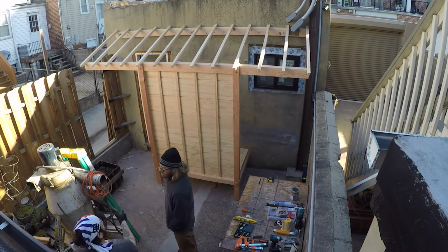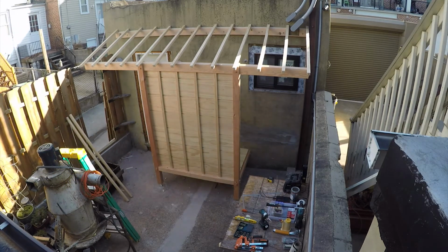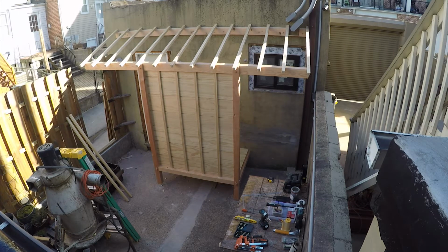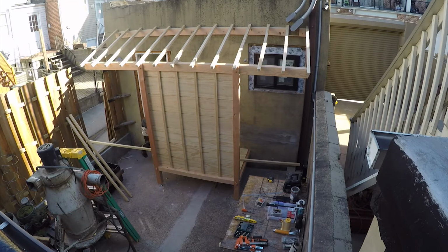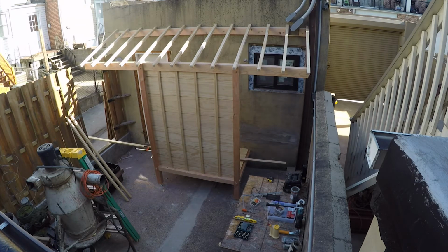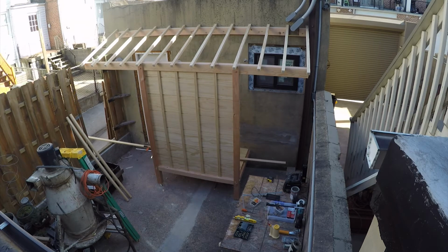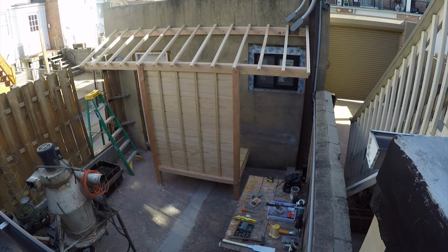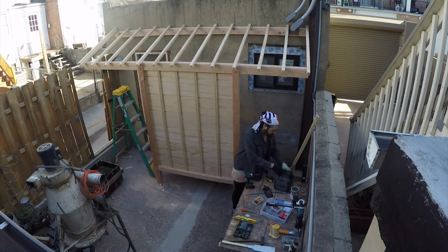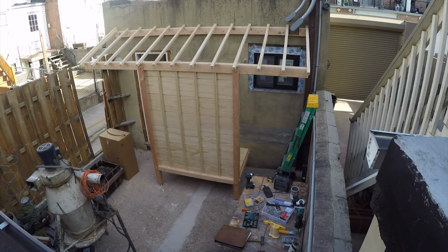So I got my friend started on cleaning up the dust collector, which I still haven't refinished just yet while I was working on the trim. The roof is trimmed with the same material as the rafters, which is finished 2x2s. There is one gap that sits in the center of the front of the roof, and this front piece actually has a 1/4-inch groove routed into it so that the first piece of tongue and groove slips into that groove. And so when you look up underneath the rafters, there's no seam and it looks really elegant. So you don't see any seams or breaks in the tongue and groove from below. All the seams are over the rafters, and the first tongue goes into the bottom piece of roof trim.